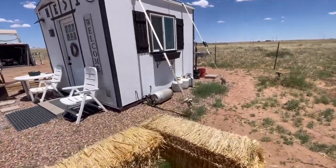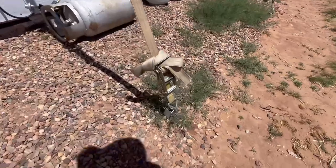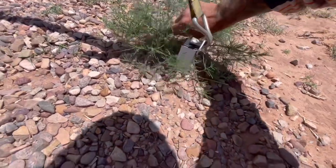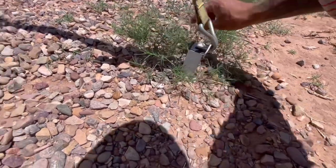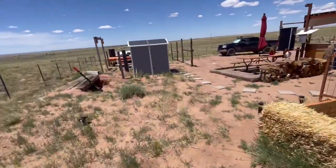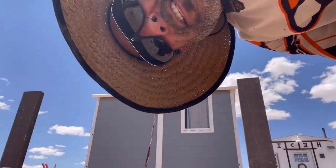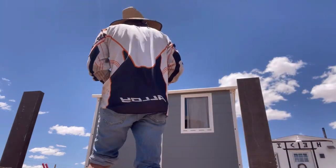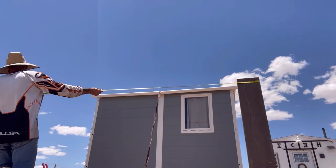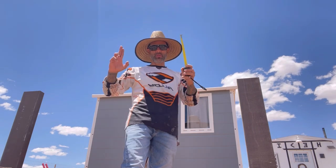I'm building this little wind protection wall. When I first moved out here, locals told me winds can hit up to 80 miles an hour. I didn't believe them but I wasn't taking chances, so I strapped it down. I put metal stakes about waist high, pounded them in the ground, cut the tops clean after crushing them, and welded pieces on. I don't like the look, but it works. Now measuring from the top of the posts — 99 and 1/8 — making sure the bottom measurement is the same to confirm they're perfectly leveled.